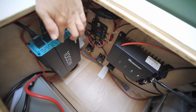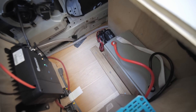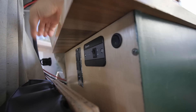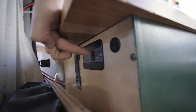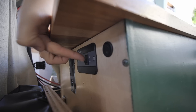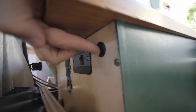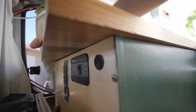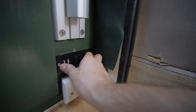I had this 1000 watt inverter left over from the previous setup, so we went with this — it's a pure sine wave inverter, perfect for what we use on a day-to-day basis. I ran a couple of AC outlets right here along with USB. This is the switch for the inverter right there, so it's really easy to just turn the inverter on and off, and that's right next to the switch for the water pump.